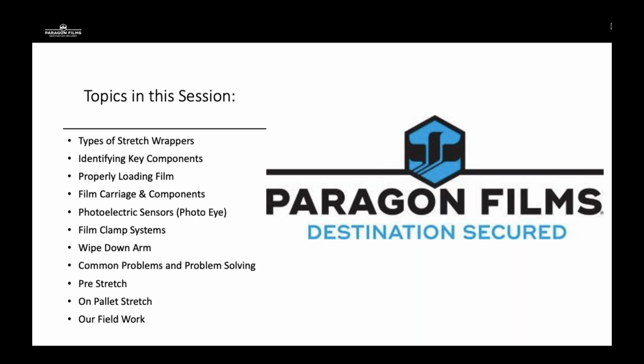Today, we're going to look at how that optimization, those audits, how we perform those, and what we're looking for, and how we can hopefully help correct current film and equipment out in the field. So today, we're going to look at different types of stretch wrappers, key components, how to load film, specifically the film carriage and its components, photo eyes, clamps, wipe down arms, a little bit of common problems and problem solving skills that we can do, as well as pre-stretch, on pallet stretch, and specifically the order and what we're looking at as we do a film audit with you and your customer.